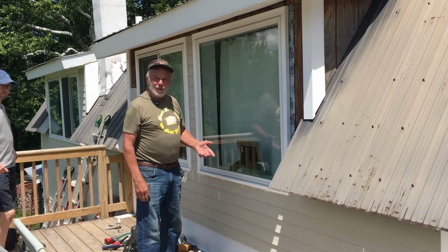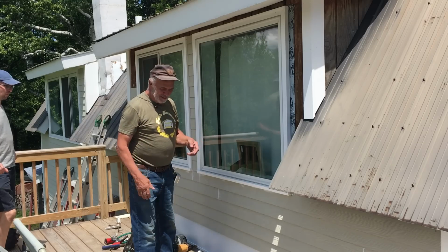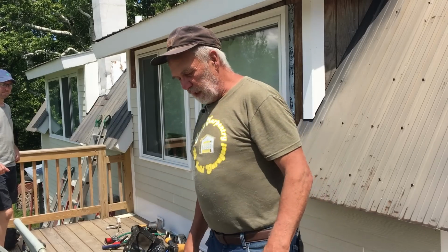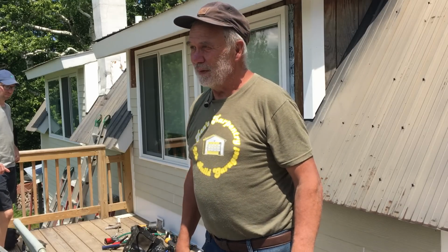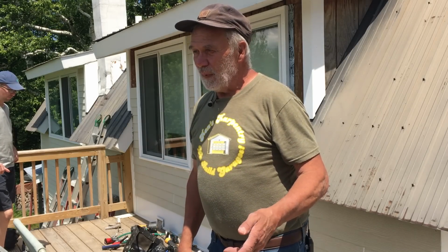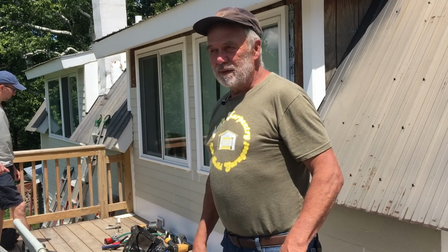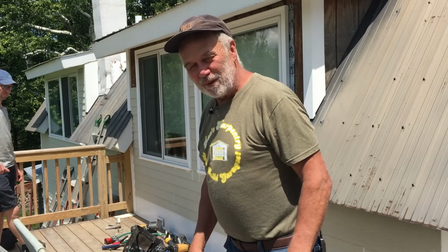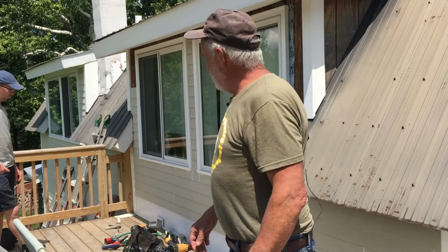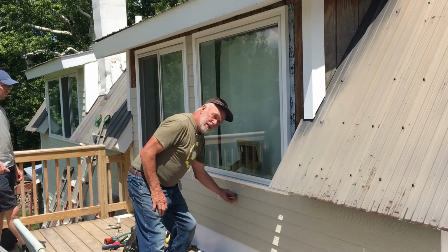It's kind of like metal roofing, where do you screw it on the flat or do you screw it on the rib? It seems like the way you build things changes. So you have to use a little common sense and just do what you think is going to be right, apparently. I think some of these cement panel manufacturers are maybe trying to cover themselves by saying, if you don't do this, we'll void the warranty or whatever. But anyway, I do agree with, don't caulk underneath the panel.